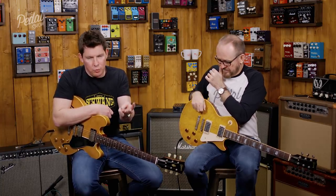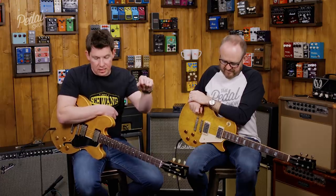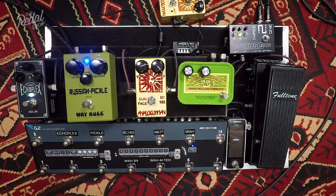It seems to me there are three variants here. One is what you just said, the fuzz face. Two is your wah-wah. Three is, where is the buffer? Because buffers are part of this whole discussion. Where is the buffer in the signal and what's it doing? We proved that the buffer built into the wah doesn't seem to make a night and day difference. In fact, the only way we got the traditional style fuzz face to sound good after the wah was by adding a buffer to the wah's bypass circuit.